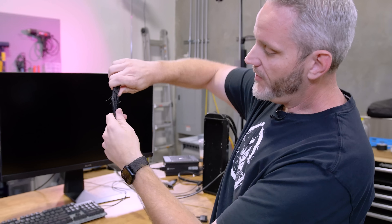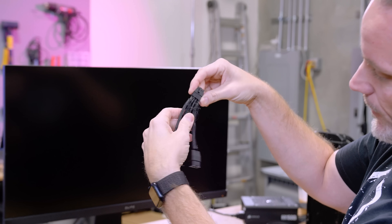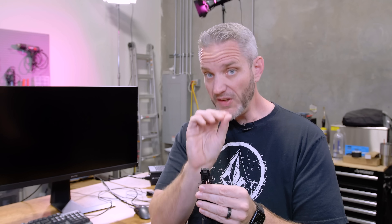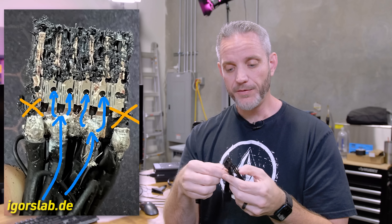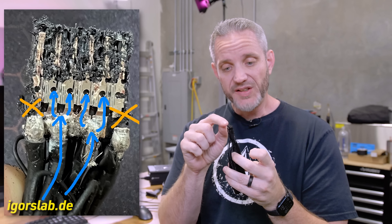Because if you're bending it this way, you've got the radius pulling on the outside wire. You can break a solder joint both by pulling and pushing. I think what happens is some folks — the really badly burned ones, like the one that went kind of live on Reddit — might have actually broken both. Which means now you have up to 600 watts being drawn, because the sense wires are still grounded and the ground is more than likely still good. Now being drawn through two 14-gauge wires. That level of heat coming through only two wires is a scenario where the temperature can increase hot enough on the plugs.